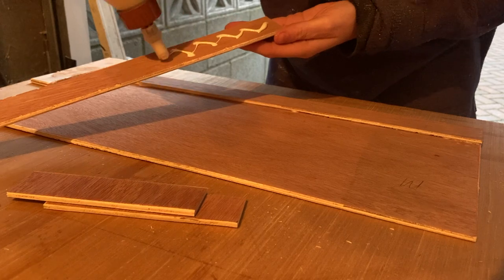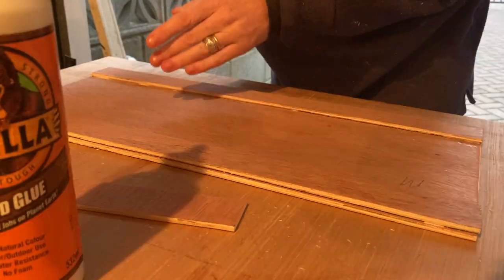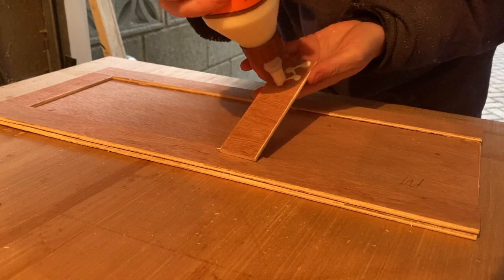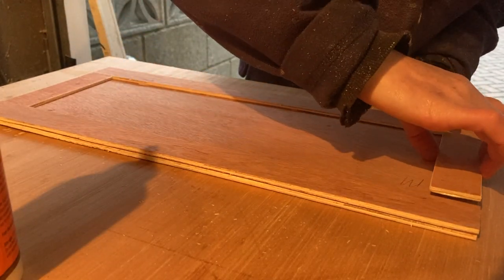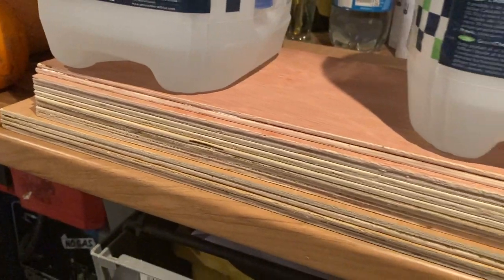We wanted the doors to match the kitchen cabinets, so we constructed them in exactly the same way — using 6mm ply and gluing a fascia of 6mm ply around the edge. We've done all the doors — all eight of them. Everything here needs filling still: we need to fill it, sand it down, and get it primed and ready to paint. That in itself is quite a large job — probably going to take us two days.